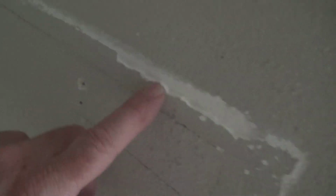See? I mean, especially right in there, look at that. See, the first day when I put that on there, I'll put some over that. See how that's in there just a little bit? And then I'll put a little bit right in there and right there where it's depressed, right here. I'll fill that up and use caulking as my spackle. Okay, and I'll let that dry, and then the next day I'll come back and put a little bit more over that, smooth it out, boop, boop, boop, wipe it, and get it all done. There's no way I can get that fixed with caulking in one day.